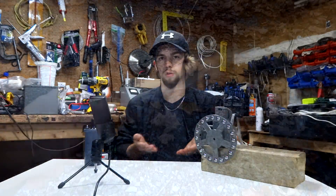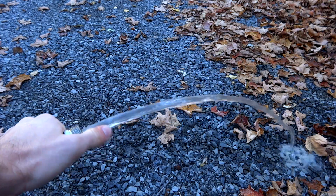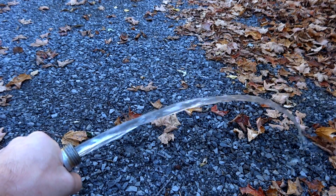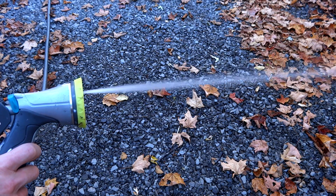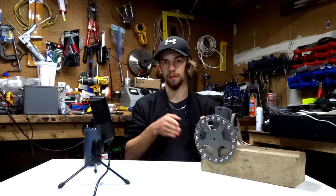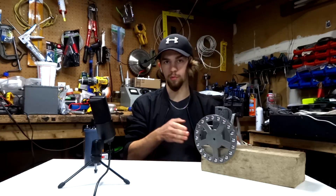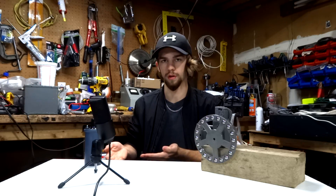Option B. Unless you've never had a childhood, I'm sure you can recall doing this. By placing my thumb near the end of the hose, I'm able to create a jet. This jet moves less water through, however it's moving it faster. If we switch from using a garden adapter, we have a nozzle now. The bucket can displace a lot more water than what the nozzle can at a given instant. However, the nozzle provides a constant stream of water, unlike the bucket. We can make more efficient use of this stream of water, because we really don't need all of the water at once that the bucket provides.